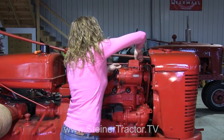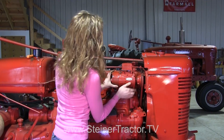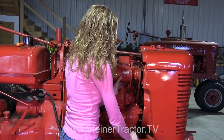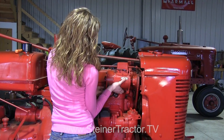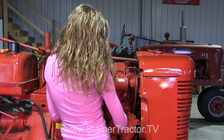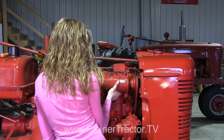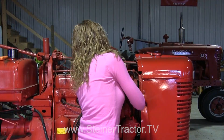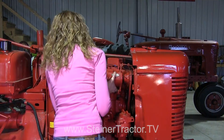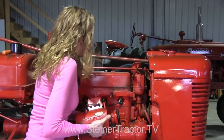I'm going to remove the wires connected through the wiring harness. Then there are a few bolts that hold in the generator — one up here and one down here — and then this last one will come out; it's kind of tight in there. Now I'm going to pull the generator out completely, and the belt will slide off. The generator is out.